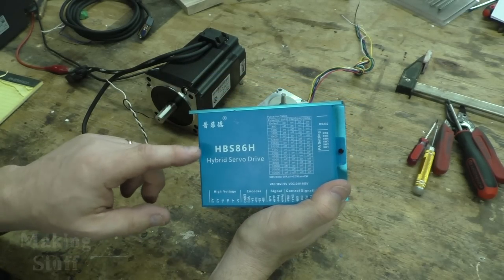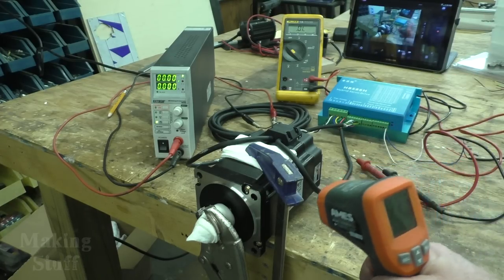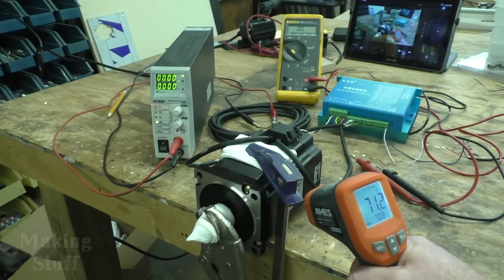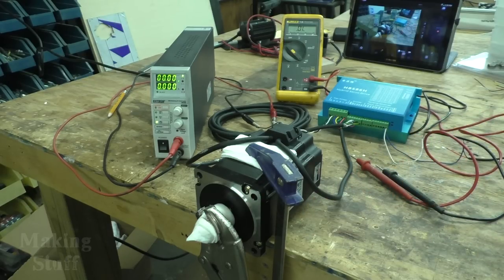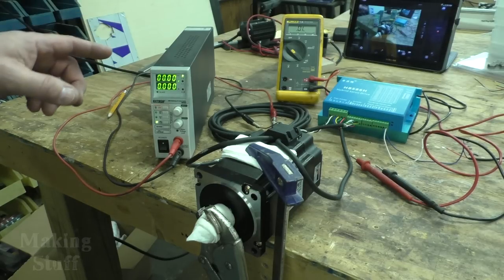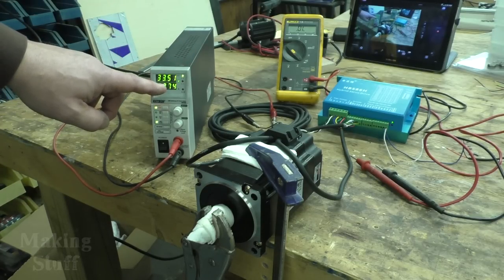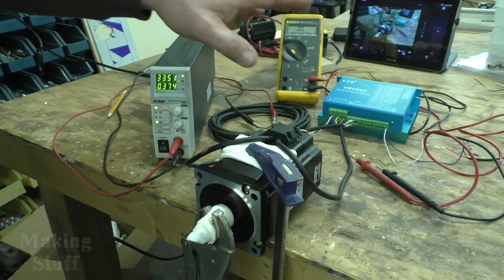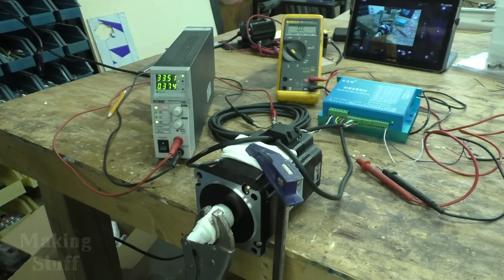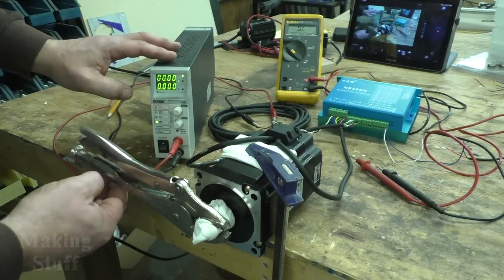Alright, I've got this all hooked up here on the bench. First thing — let's get a temperature reading. We can see it's 71.1 degrees Fahrenheit, which is pretty much room temperature right now. I'm going to power this on. This power supply sends 33 volts at about 375 milliamps to the controller and motor. The power supply has a 2 amp limit, and the motor and controller have a 9 amp peak, so this isn't sending the full amperage the system is capable of.